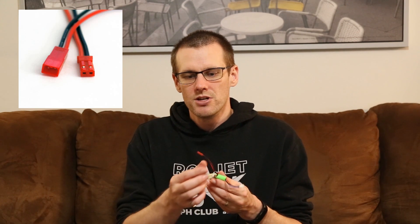Now that we know how much current we're going to draw in our power system, we can go ahead and match that up for a set of connectors. Let's take a look at connectors rated from around 0 amps all the way up to 180 amps of continuous current. We'll start off right on the small end of things. This connector here is good from 0 to around 5 amps of continuous current. It is known as the JST-RCY connector.